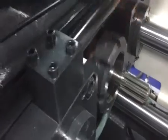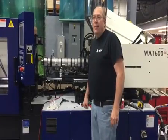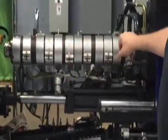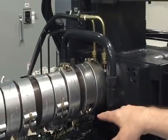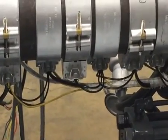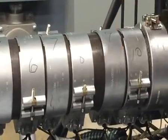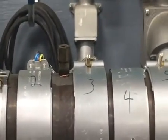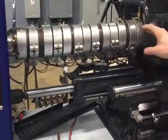Here we are with step 21 of our barrel and screw change on our MA 1600 ton machine. As you can see, we have all the heater bands put back on the machine, the water jacket, and the water lines for the water jacket are installed. When you put your bands back on, you want to make sure you have them orientated correctly or you'll have a very difficult time putting the barrel cover back on. Also make sure you have the spacers for the barrel cover and the thermocouple wells installed on the other side of the machine, so you get the correct orientation of your bands and don't have them over top of one of the holes.